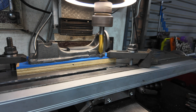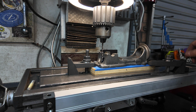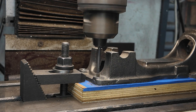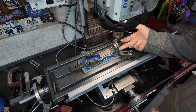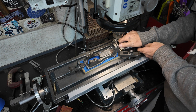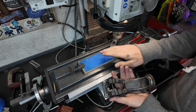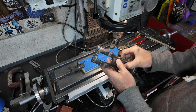There we go, we've just got a little dimple there to make sure it starts without wandering, and then we'll go across and do the other side. So after all that rigmarole we're finally ready to drill a hole — I'm drilling 3.5mm and I'm going to ream at 4mm. We've got all four holes drilled and reamed. Now we just have to get our casting off of this taped-down surface, which shouldn't be too hard — normally it just takes a bit of gentle prying. There we go, up she comes. We've got no glue residue, no problems, and we've got the coordinates of these holes exactly, so we know the distance apart.